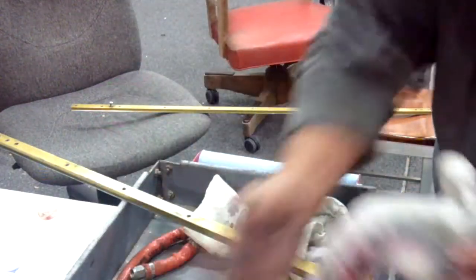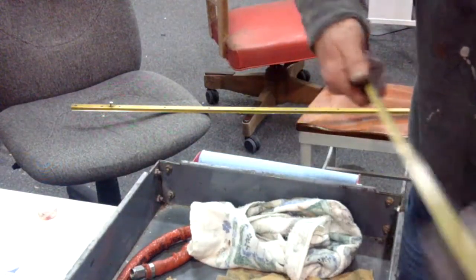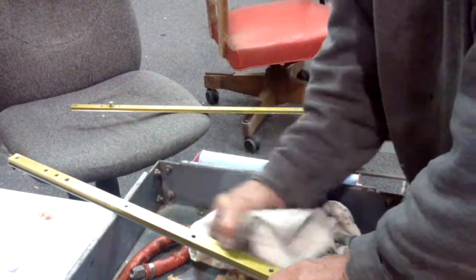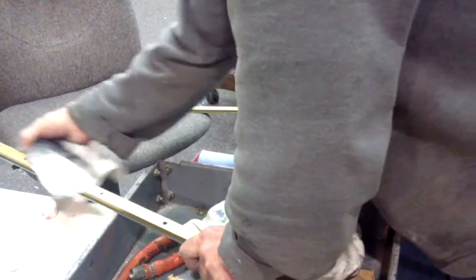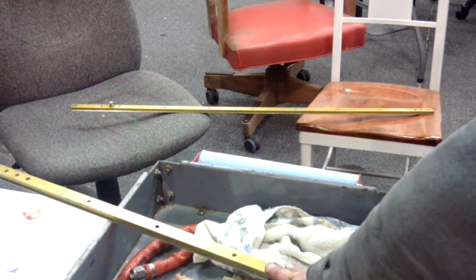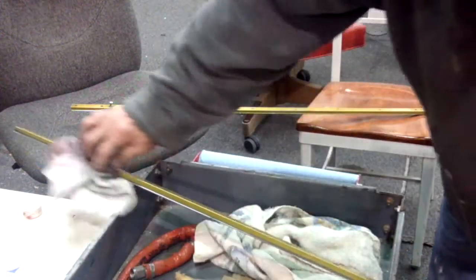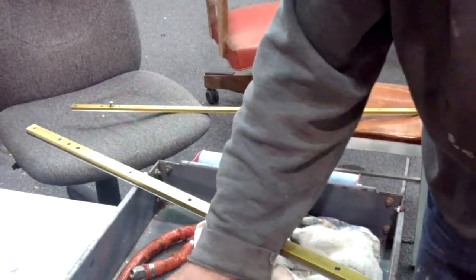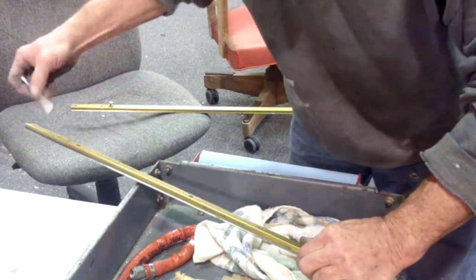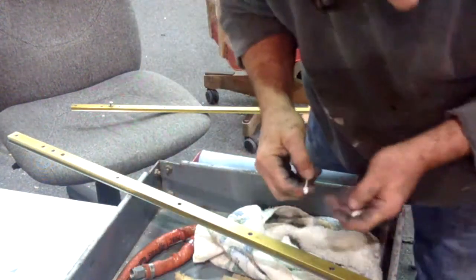I've already cleaned one, now let's do the other one. We've taken the canopy buttons out. First thing we're going to do is give it a good broad cleaning. I'm using lacquer thinner because it just cuts through a lot of the debris in here — a lot of it will transfer to my hands. I've had customers with canopies that have not been off their airplane in 30 to 35 years where you can actually spend an hour in the parts washer with mineral spirits and scrub brushes and toothbrushes to get all of this clean again. Now I've got the bulk of it off. We're going to go ahead and take a Q-tip and run through the track in these corners, clearing out the last of the debris. Look at all the debris that I pulled out — and that's after cleaning.